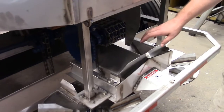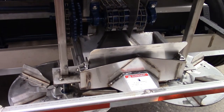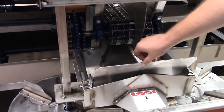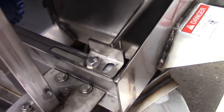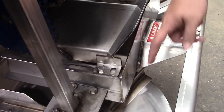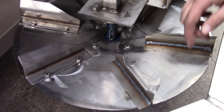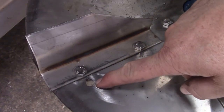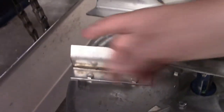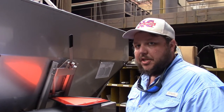The Model 48 NC Series does not have a fully adjustable chute like some of the larger spreaders. It has this piece that we call a duck tail, and it does have some adjustment. Proper placement in our testing is you put a bolt in the first hole only and it slid all the way back. The blade position is very important — every other one: this one no hole is showing, the next one has one hole showing, no hole, one hole.